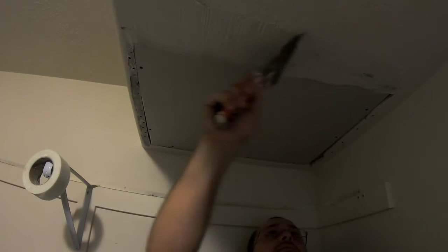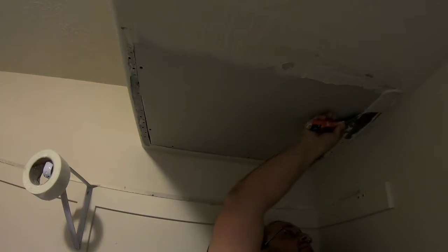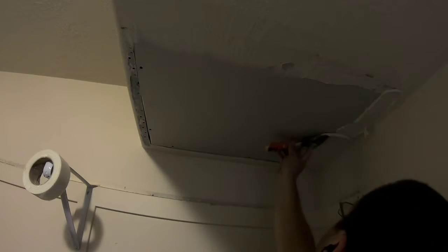It's important to note on pre-fill, see how tightly I'm wiping it? I'm not leaving any excess mud on the outside. I just want mud on the inside of those spaces and gaps. So we want to wipe it extremely tight after we get it up in there.